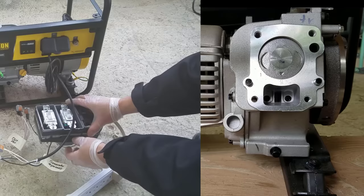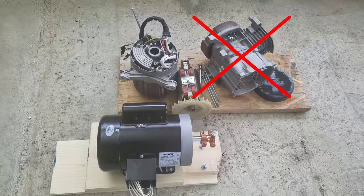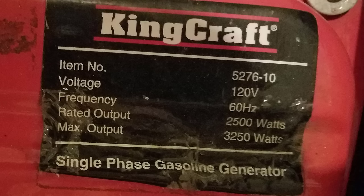So we can eliminate the manual switchover and cut down friction. We already disassembled the second generator. We can eliminate the crankshaft and the related components. The components were from a 3200-watt generator — about twice as big as the first generator — and it makes 120 volts versus 110.